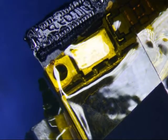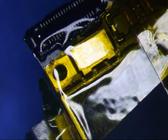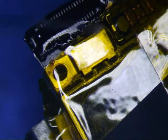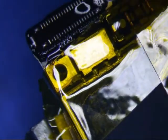Let's get the big iron now, get a little flux in there, and get all the low melt off. You don't really want to solder with low melt because it does not conduct electricity as well as leaded solder.